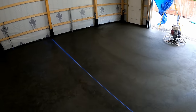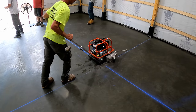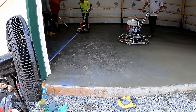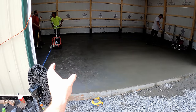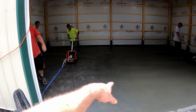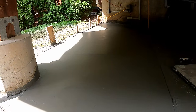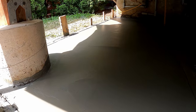I decided to do a control joint line at each post to keep it in little eight-foot sections. He's got this wet saw designed to cut the concrete when it's still green. We got the depth set at around 1 and 3/16 inches - generally you want to cut about 25% of the thickness, so like 1 inch for a 4-inch pad. The idea is as this whole pad shrinks it will hopefully crack in those control joints, and of course the rebar is going to hold everything together. I'm hoping these lines don't interfere with where the lift is going to go. This little pad under the deck came out nice too - he ran ahead and finished that, probably better than I would have.